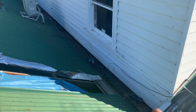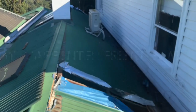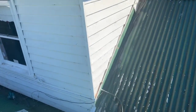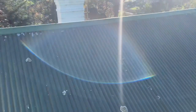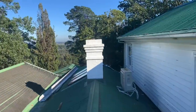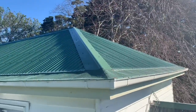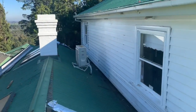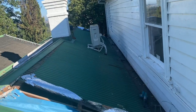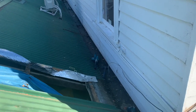Then we have to get my carpenter friend to do all the carpentry and reframe underneath the gutter so it all falls down that way properly. There's an air conditioner to deal with — won't worry about that today, that'll be the next day. There's gonna be lots of different days here. This whole roof here is getting replaced, so weathering and sealing it to the wall is going to be a bit of an issue — that's going to be a fun job. There's a few chimneys to flash around — that one, that one. The top roof was redone four, five, six years ago. So at the moment I strip this side of the roof, leave the air conditioner, strip either side of that, strip that weatherboard off the very bottom one, rip the gutter out — and then I'm committed. Then I've got to redesign some new timber boards.